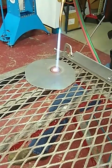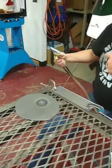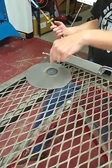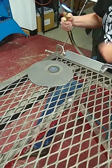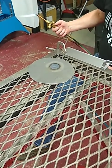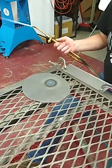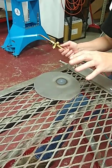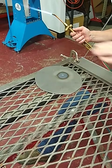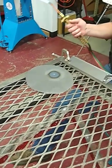Watch when I pull straight out. That outer feather acts like shielding gas — it's burning up the oxygen while the material is at molten state. If I pull away too fast, oxygen gets in and you'll get porosity, and that's not good. So that took probably four seconds, which is okay. On a complete surface we're doing two edges, so that edge is going to melt up fairly quick.